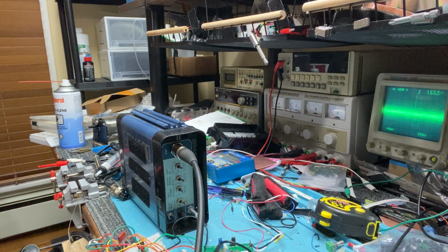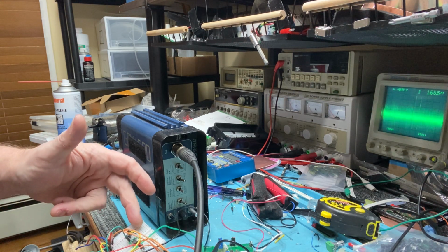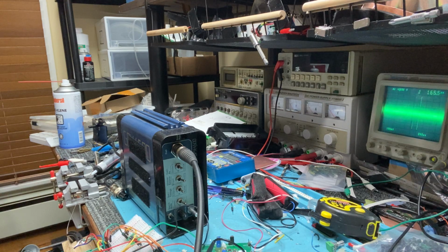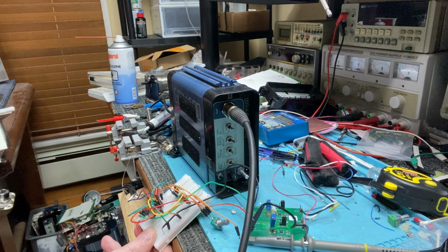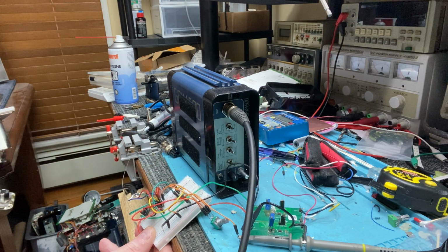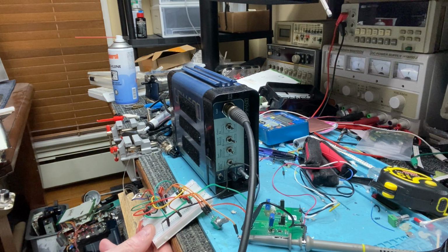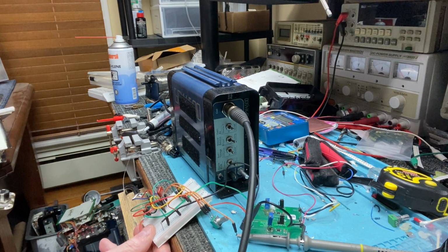Now, I'm going to unplug this because I haven't got the audio on. I didn't know if it was on or off. Hopefully it was off, and it's off now. So basically all I've got in there is an op amp. I just put it on a little board, a converter board from DIP to SOIC, and use the DIP pins so I could push it into this proto board. All you've got to do is put the pot between your voltage rails and onto the inverting input of the op amp, which on most op amps of that type is pin 2, and the Hall effect output goes on to pin 3.